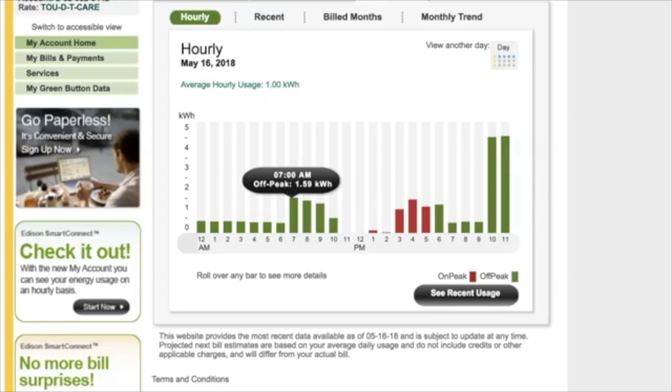Wow — one point six kilowatts, three times more from one person getting up. Crystal gets up and turns on the lights and the coffee maker. It's not a vacuum — 1,500 watts for a single vacuum. We have super low energy lights. I think it's probably the hair dryer — that pulls maybe 900 to 1,000 watts — or the coffee maker, which heats up water and could pull around that amount. The microwave would pull about 1,500 watts but ours is tiny.